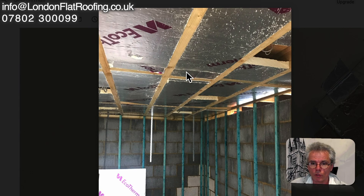Companies like Siga talk about their tapes, how good they are, tested to last 25 to 30 years, with massive product guarantees. People don't realize how expensive and time-consuming it is to install a good vapor barrier correctly. If he had the taped vapor barrier in, it would be airtight, and the air tightness would help control the movement of moisture up into the voids above — because of the vapor control system and the absence of air leakage.